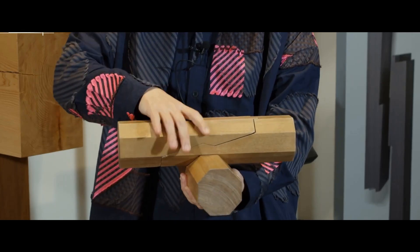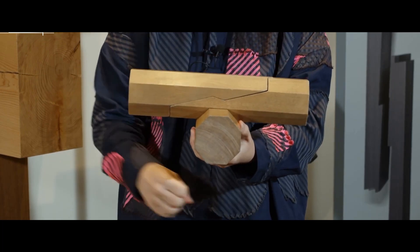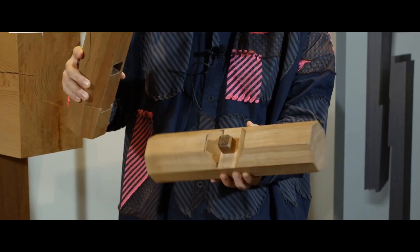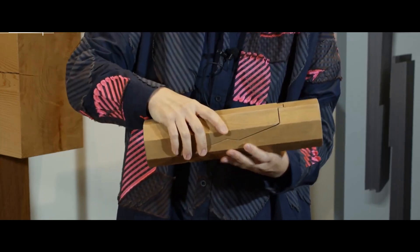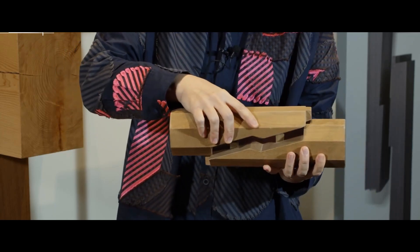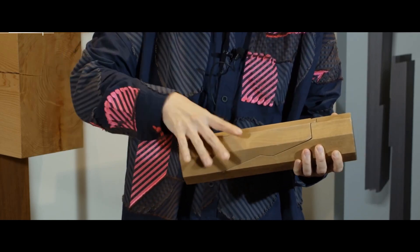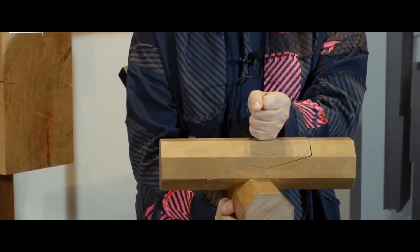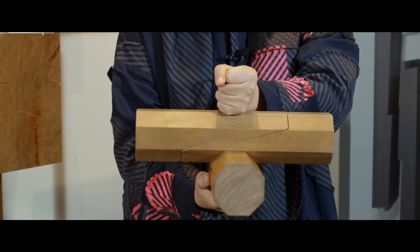This is the hands-on material of the daimochi joint. A pillar comes below this, and this is a member that is orthogonal to it. If you remove this, you can see inside. Removing this long beam member reveals the inside — it can be removed easily in the upward direction but cannot be removed in the horizontal direction. Additionally, a strut comes above, so there is less impact even if a load is applied or shaking occurs due to an earthquake.